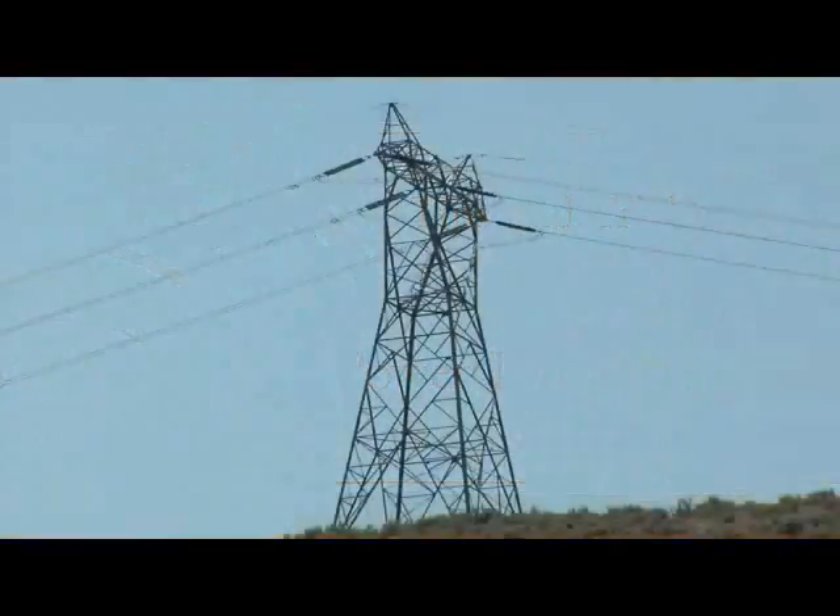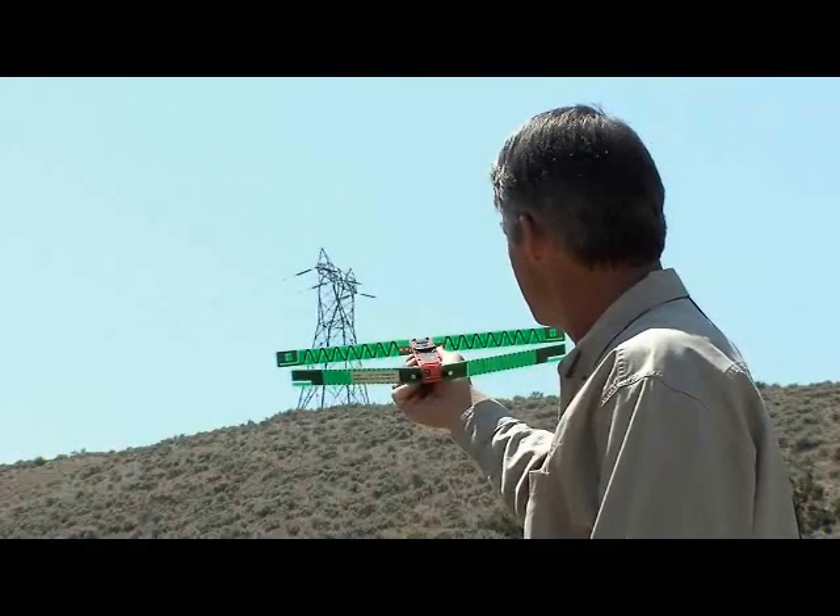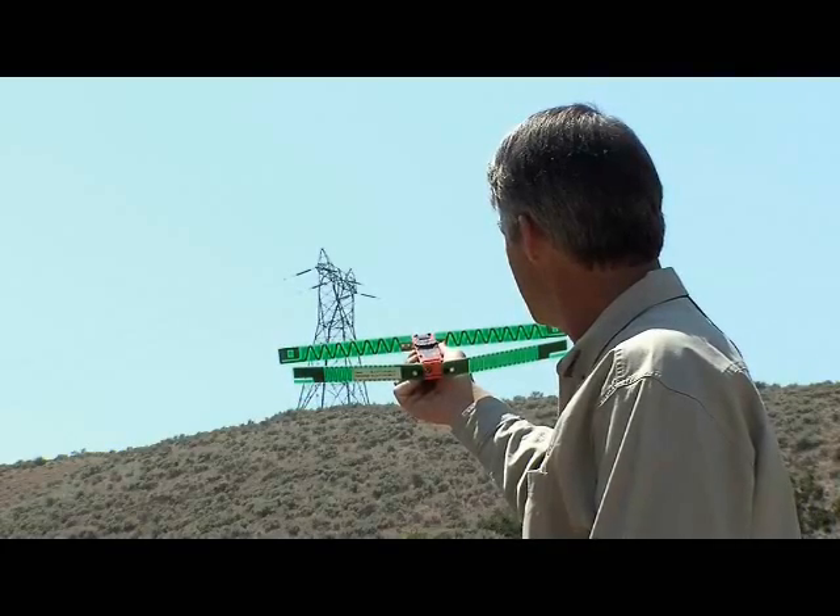Power lines, particularly transmission lines, can cause a lot of confusion. Often the signal seems strongest when the receiver is pointed directly at the power lines. To determine which side of the power lines the transmitter is situated can be difficult. The best strategy is to walk to the power lines and, with your back to them, set the gain on the receiver by only sweeping away from the power lines. Then, without changing the gain setting, move to the opposite side and do it again. After a few attempts, you should be able to tell which side of the power lines the transmitter is located.